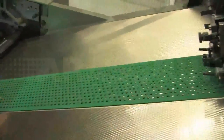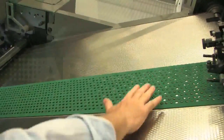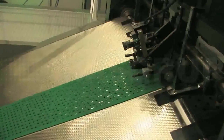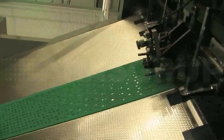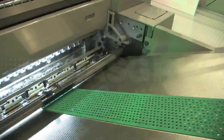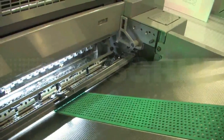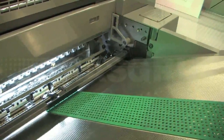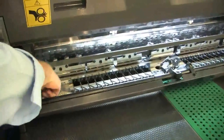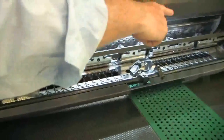There are zone controls because when we have a different number of sheets or a different thickness of sheet, we need more air, medium air, low pressure air in this point. We've got default settings, and then the KHSAI works together with this air system, and if we modify it because of a different paper thickness or a different sheet size, the AI remembers it and modifies it next time by itself.